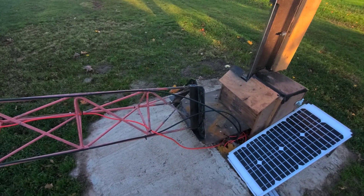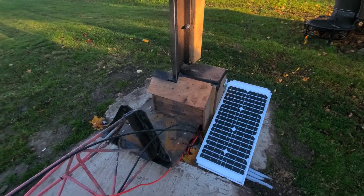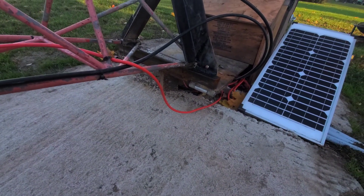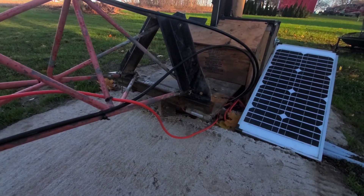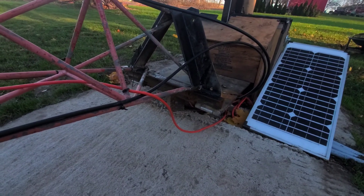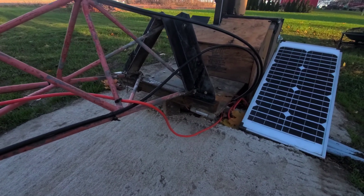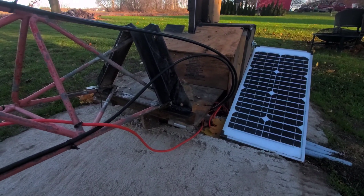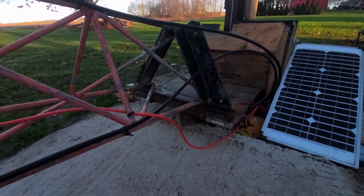The hinge plate is just welded on my home built base there. It's three by three angle, three pieces of that, welded together, it's down there four foot six. There's cross pieces in there, welded together. And the top plate is five-eighths steel there. There's a couple heavy hinges there.